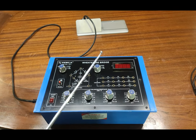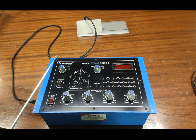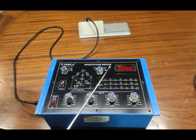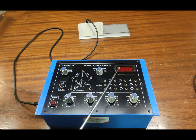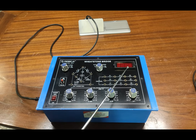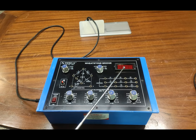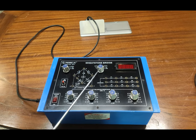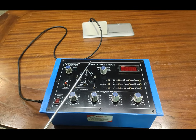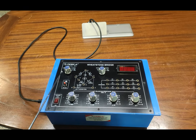I will explain all the different parts of this trainer board one by one. The board consists of the following built-in parts: a 5-volt DC 100-milliampere IC-regulated power supply, which is internally connected to power the complete circuit. There is also a digital galvanometer with a seven-segment LED display, by which you can read the values of any imbalance between the arms. This is the six-decade resistance of different range — this is the P arm.